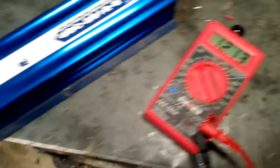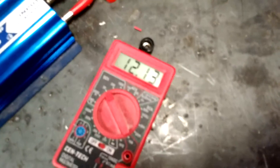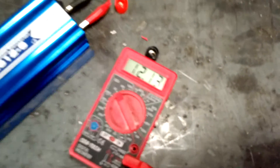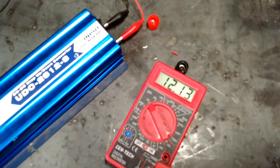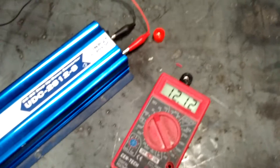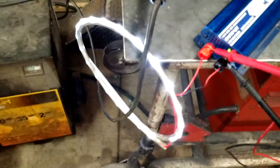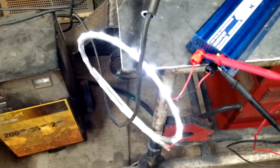I've attached the LEDs to the output and we're getting a 12.1-volt output. This particular buck boost — I've actually tested it, and I threw 24 volts into it when I first got it, and it still delivered a 12.1-volt output. It varies very little, well within the range of what most electronics are designed to handle.